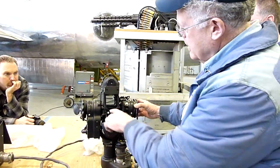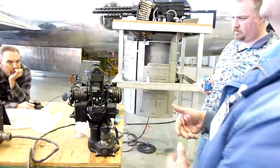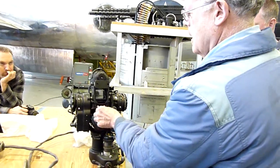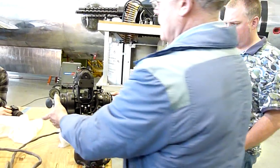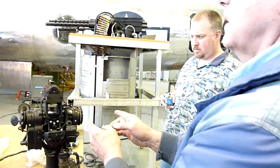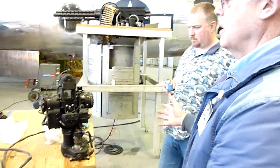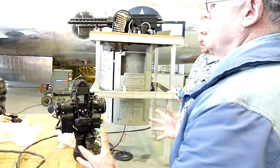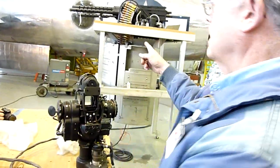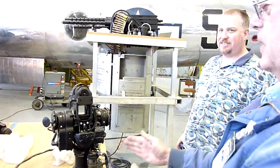There's also a number scale up there. If he's shooting at a Japanese Zero coming head-on, the Japanese Zero had a 40-foot wingspan. He cranks 40 in by turning this knob, and by moving the knob it changes the diameter of that circle. He keeps it touching the wingspan — that inputs the range. Without the range being right, you could imagine all the other things would not work. Another input into the computer is parallax. If he's shooting that gun from back here, you've got an angular difference. The computer takes care of that — if he gets his range right, it adjusts for the parallax.